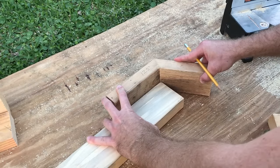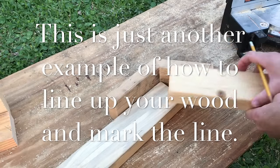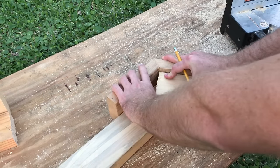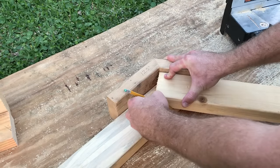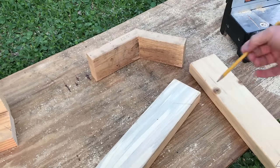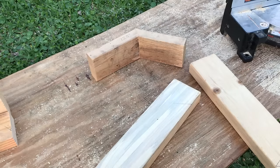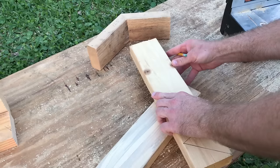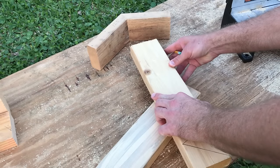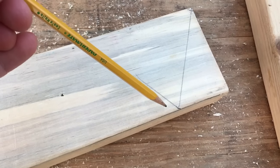Put a piece of wood in and secure it to the wall right in the corner. Bring the other piece in and get it secure — everything is tight. Mark right here. Then I want to make a line from here to the corner of this line, to the corner of the board, and that will be the cut line I need to follow. Let's mark it out. That line from here to here is going to be where you want your saw blade to run to get the correct angle.